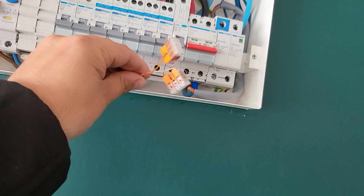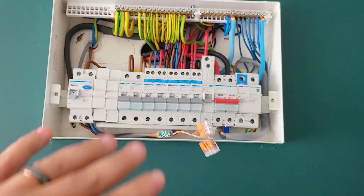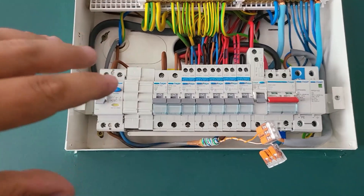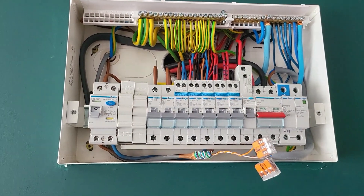We've got our twisted pair here ready for the CT clamp that we can put on the main tail. Point of note: this cable is rated for the maximum voltage so it's quite fine going within a consumer unit. Now because the Zappi has RCD protection built in and pen fault detection built in, you don't need to put any upfront RCD protection onto the charge point itself.